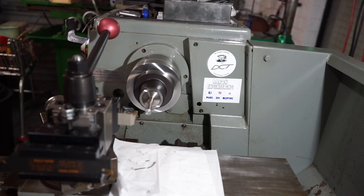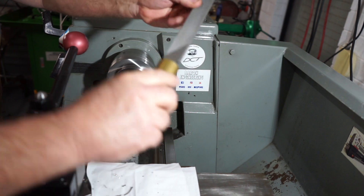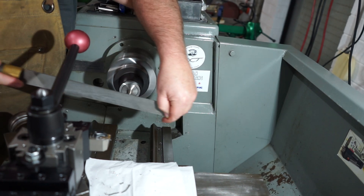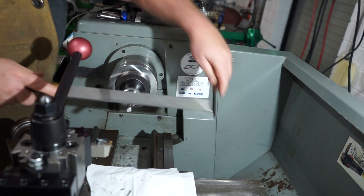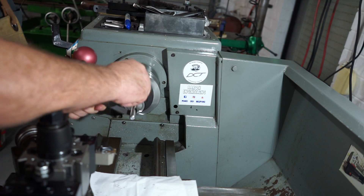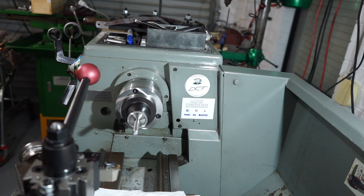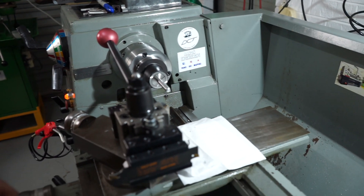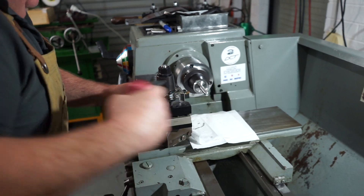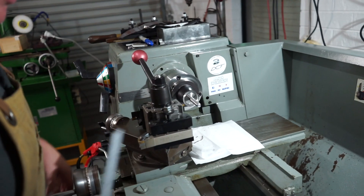Now Wayne has asked for a dome on the end so I'll just file that a little bit with my lathe file — it is actually a lathe file. I'd like to give it a quick polish. So this time I'll start threading. But before I do that I'll set up the parting tool so we can jump straight into parting and part it off. I'll be parting these off just a little bit over two inches, which is 55 mil.